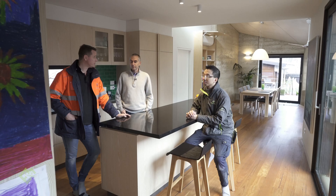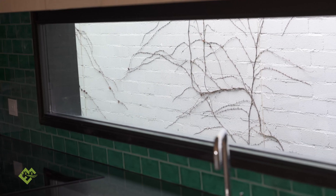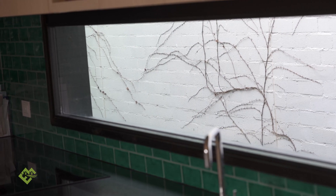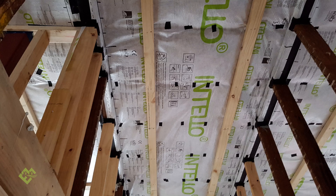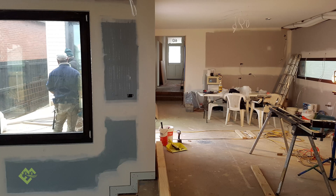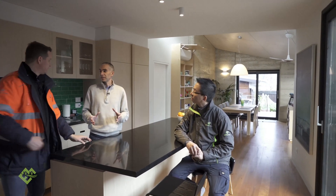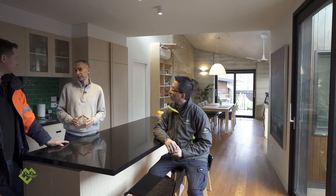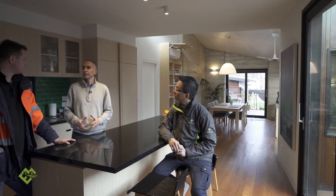The kitchen and living area is all new. The 1980s extension was demolished — it had no insulation and leaked badly — and they built fresh. That was the easy part: a clean slate. The old part of the house behind it is the tricky bit, requiring retrofit of insulation and airtightness into existing construction, which gets really, really tough.